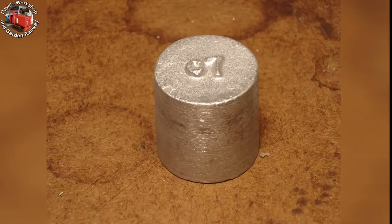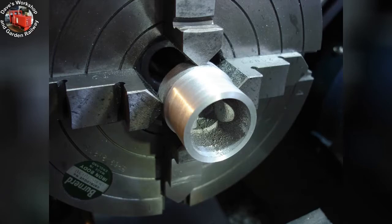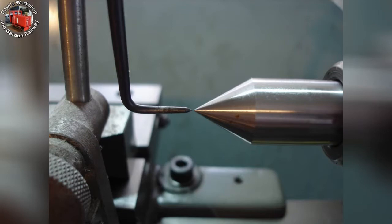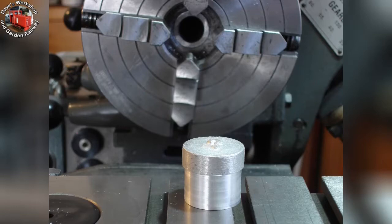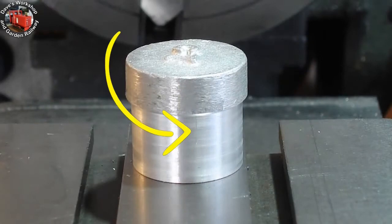Here is the top surface of the cast piston — there is no chucking piece. The internals with gudgeon pin bosses cast in. The outside diameter rough turned to oversize. The internal diameter has been skimmed to size as a register for the turning jig. Setting up my scribing block base to scribe a line at centre height — spot on. Scribing a line at centre height on each side for drilling the gudgeon pin wrist pin. The line is scribed, hopefully exactly at the centre of the cast gudgeon pin boss. These instructions were gratefully found on the Model Engine News website — link in description.